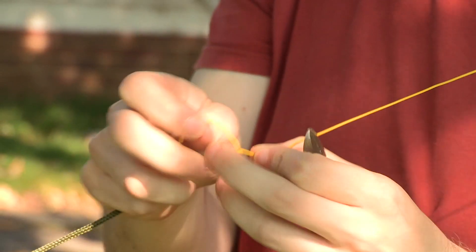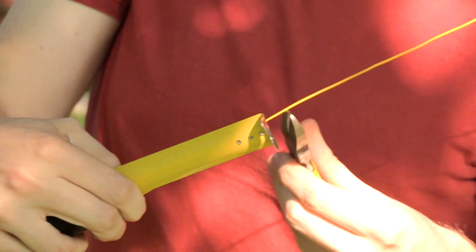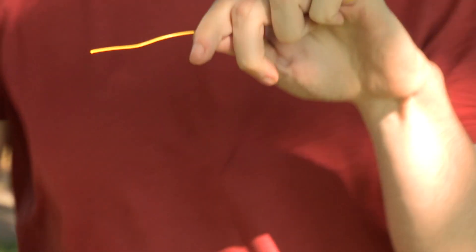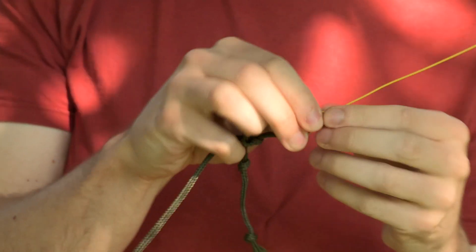It's not just a two meter or 70 centimeter small antenna that these principles apply to - it also applies to HF. If the SWR on your dipole is such that it needs shortening, measure a section from each end, cut and recheck as we've demonstrated. Make sure that you cut small lengths equally off each side of the dipole until the SWR is as low as possible for the band you're transmitting on.